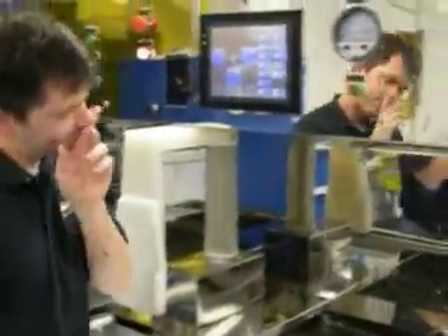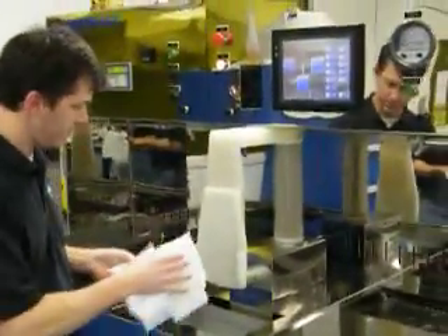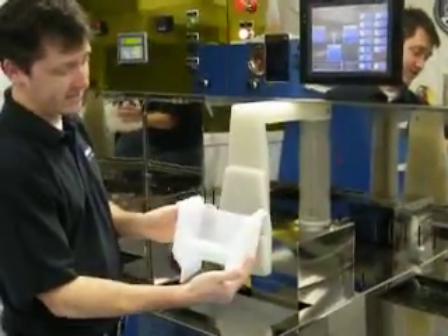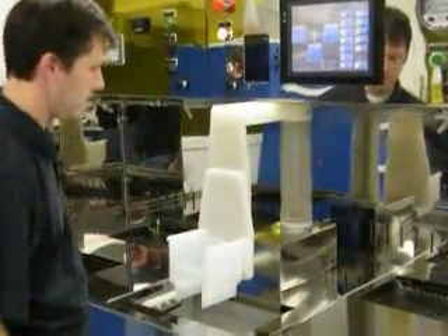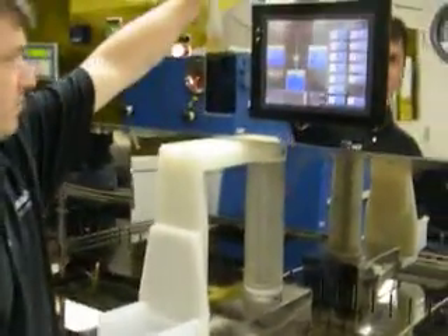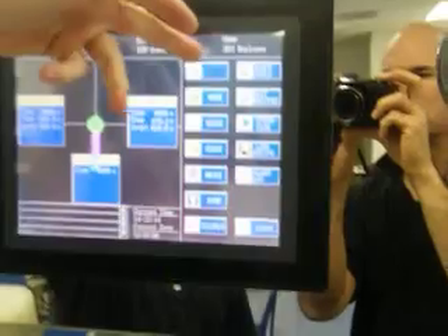We'll demonstrate starting the automation and starting the robot. Take our six-inch cassette — notice on this end effector, the H-bar is facing out. H-bar out, and it just loads right in place, hangs on the two hangers. From there, we should make sure that our robot is in a home state. If not, you need to power it up and home it.